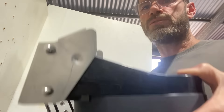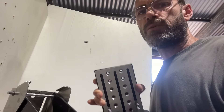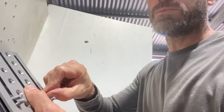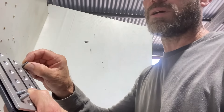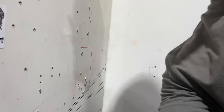Steve here again. You've got this transducer and you can easily adjust it without having to get screws and things down there and re-siliconing it — that type of thing. This makes it a whole lot easier. We have a stainless steel plate; the bolts can move within the slot. The bolts can't turn because they're locked and captured into the stainless steel. This is how it works — fit it anywhere on the boat you need. I'll just turn this around so you can see it. Let's pretend this is a boat.